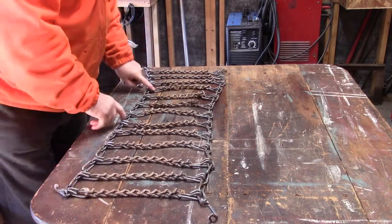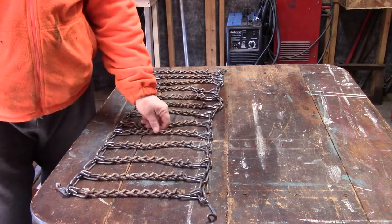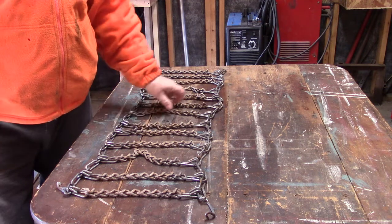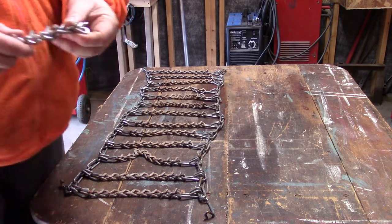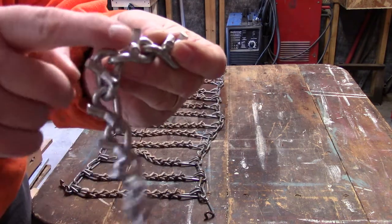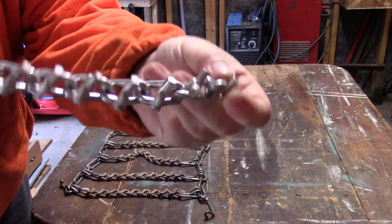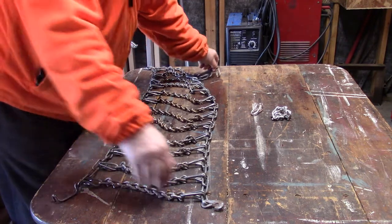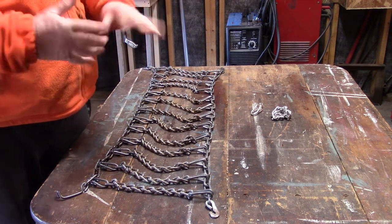Here's one of the front wheel chains. On the front wheels of my tractor I've got ice chains so that they can dig into the ice better. Now these chains are going into their third winter and the ice picks are pretty well worn off them, so now they just turn out to be ordinary bar chains. You can see on these cross links, these barbs were put in here to dig into the ice — that's what makes them ice chains, cross-link ice chains. On my tractor I don't have a lot of inside clearance on the front or the back wheels for bulkiness when you join the chains together.